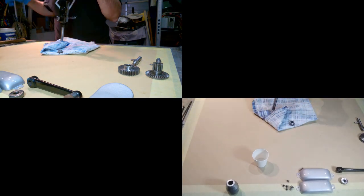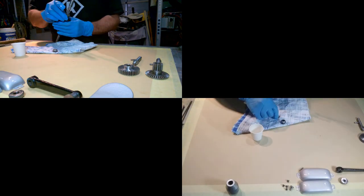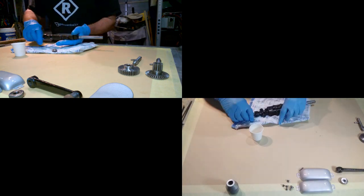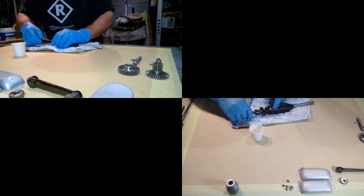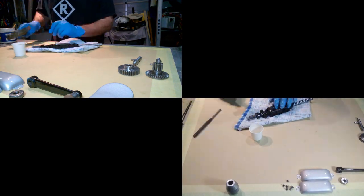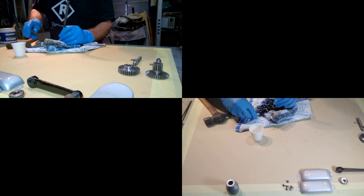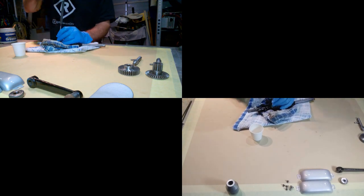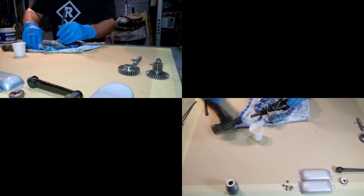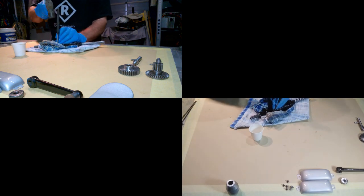The assembly is a little bit easier than the disassembly, because we're not fighting with the pins securing the gears. The reassembly is also easier because we're now in the final stretch of this restoration project. You may have thought that the main shafts are identical, and you would, as I was, be wrong. The main gear shafts are not interchangeable, as the pinholes are in slightly different positions.